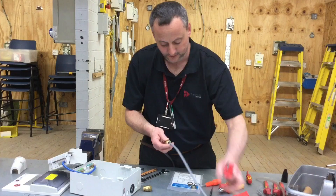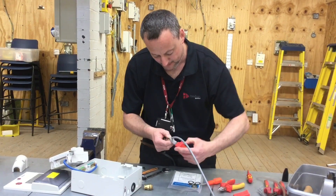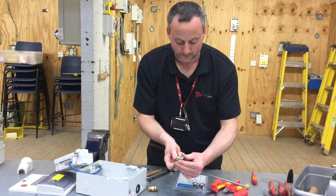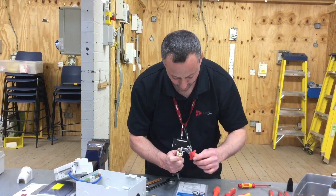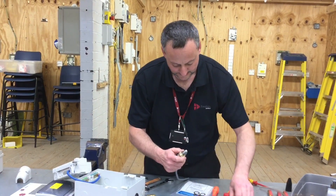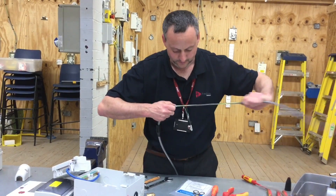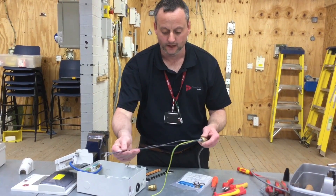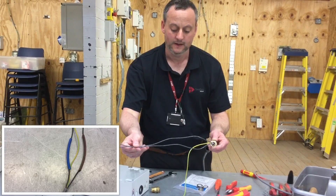At this stage you can remove the outer PVC to expose the conductors — about 15 to 20mm — so we don't rub against the body. Exactly the same technique as we used with the steel wire armoured gland: gently score round, fold it over and wait for it to burst, then rock the knife in as we did with flexes earlier in the course. Our three-core SY flex has a green-and-yellow circuit protective conductor and two black conductors numbered one and two, which we identify as line and neutral at the ends, ensuring corresponding numbers are at the other terminal. We will prove that during the testing process.